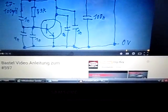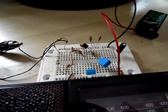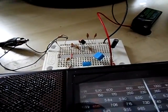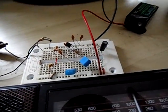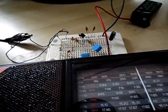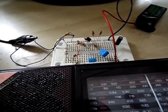Already a couple of people have rebuilt the transmitter and everyone who rebuilt it got it working. The only complaints I received were about the low range, but I intended this to be low power because, as I said, in theory it should be license-free in most countries. It's also inductive transmission — the coil generates a magnetic field which is picked up by the radio, which also means the device is in theory legal.